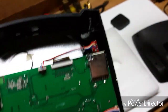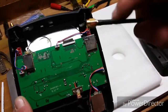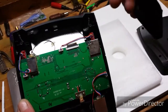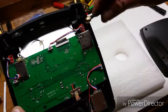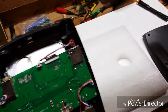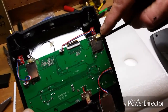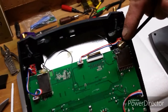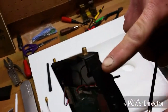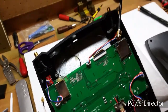Just take your time. Or you can take an entire antenna, cut the SMA off, and then you're working with a lot more wire. I've seen people run them out the sides because you can bend these around, and you would just split this and solder it the same way — but you'd be dealing with a lot thicker wire. There's actually a little spot right there where you can have an antenna coming out like that.